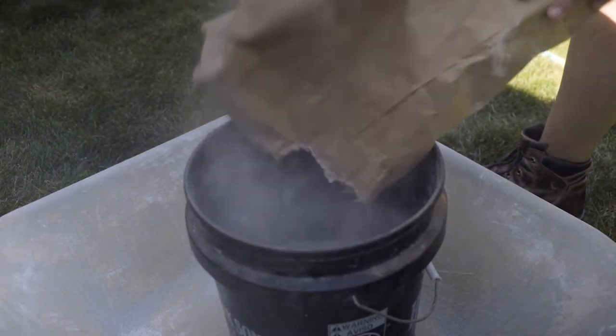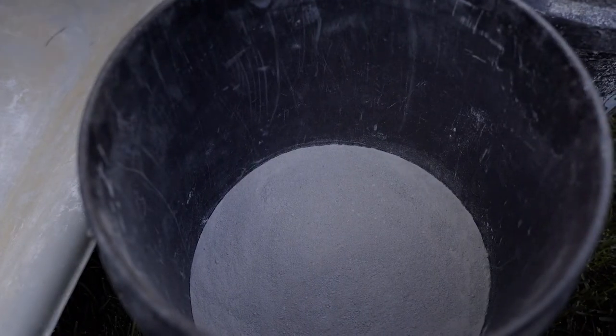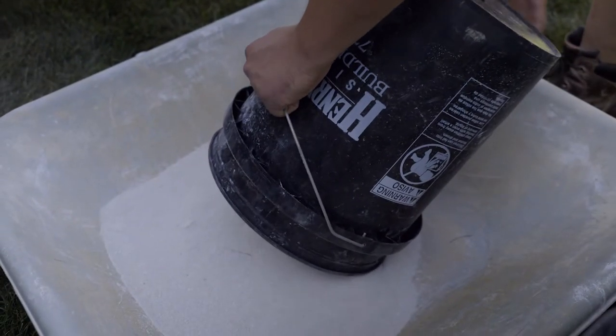Matt's using a hydraulic lime mortar here, mixed with two and a half parts sharp mason sand. It's important when you have wide joints to have a very coarse aggregate. Typically the rule of thumb is the largest aggregate in the sand should be one-third the width of the joint.